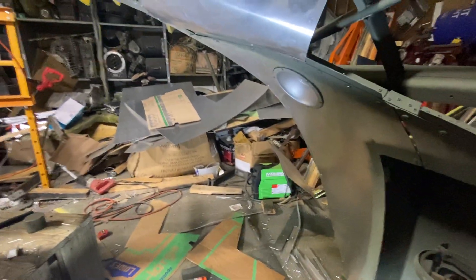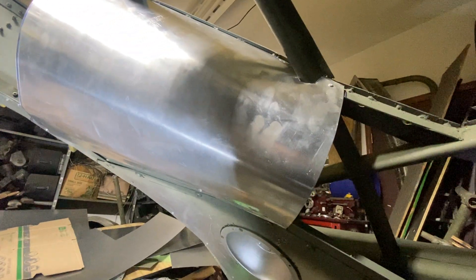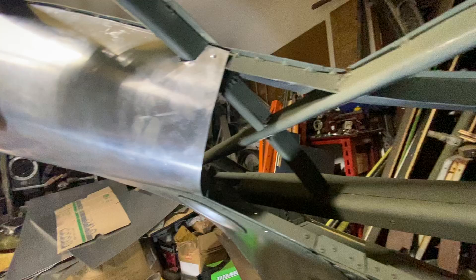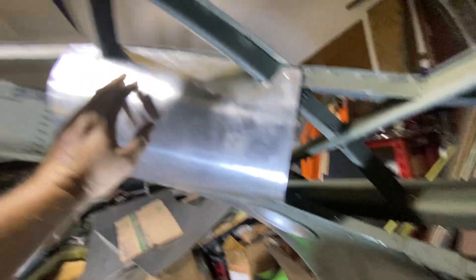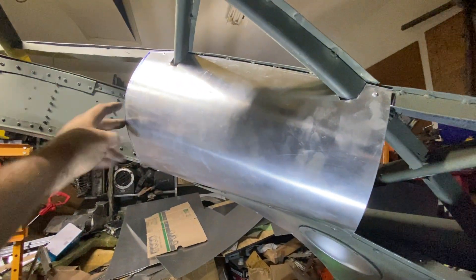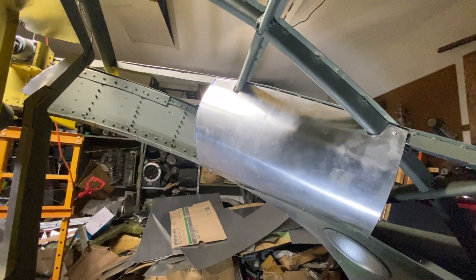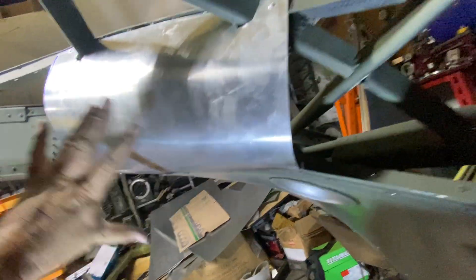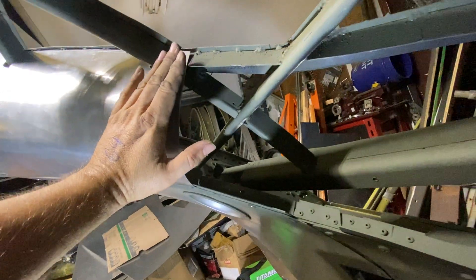Man, this kills me bending over and crawling around in here — that's why I'm always grunting, because of my knees. There's a significant amount of study that needs to be done here. I might even have to incorporate some kind of a beam to carry that around there to make sure I stay true. But this is an actual panel — there's a rivet line here and here, just like you'd see on the real aircraft. It's about nine and a half inches long here and up to eleven and a half here, so we're right on target.